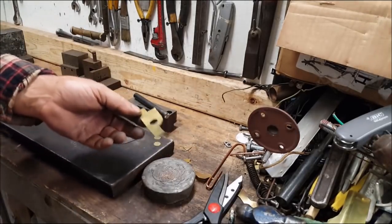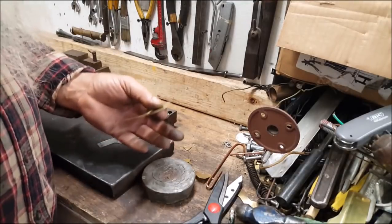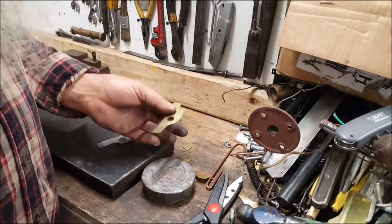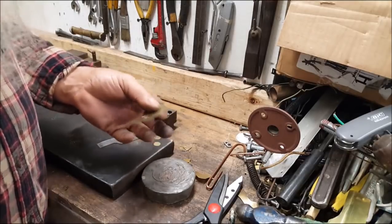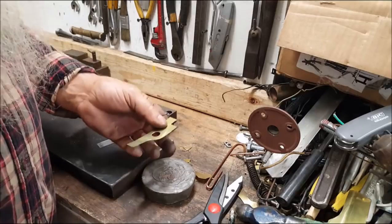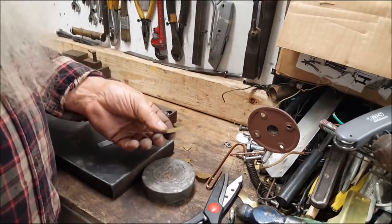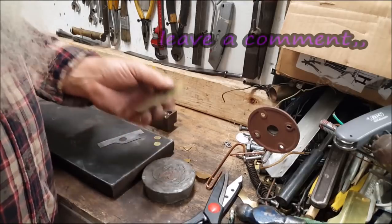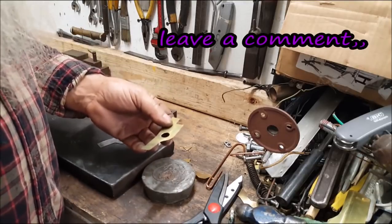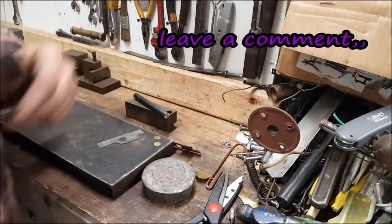And that way, the beauty about using thin shims, say you need to put a shim in there 5 thousandths thick. Well, you don't have the option to adjust it later on. You can take that 5 thousandths shim out and put 5 1-thousandths shims in there. And that way you can adjust it 5 more times, 1 thousandths each time.